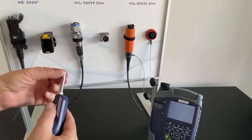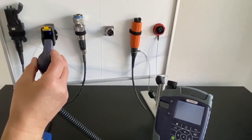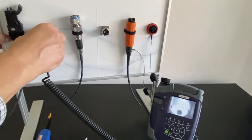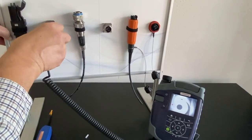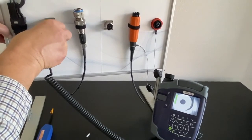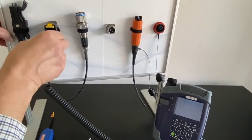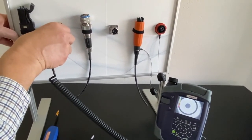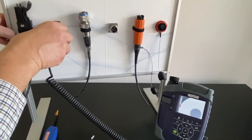Before I clean that, I will remove the cap fitting and go inspect the other two ferrules with the hollow pin guide. This is now an APC — let me just focus it. There you go — looks very, very good. And the other one, which is a PC — there you are. You can see the whole contact area is very clean and the fiber as well.